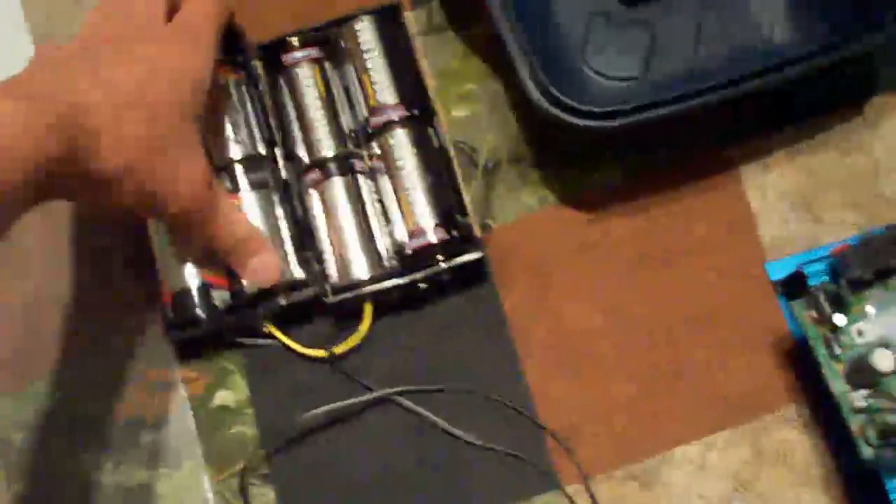The second step was I took apart this miniature amplifier and I am going to put it into the plexiglass. The third step was I made a 12 volt power supply for the amplifier. I've got the speakers and the mineral oil — everything under this plexiglass will be immersed in mineral oil. Above will be the battery packs, the control panel for the power supply, a hookup for the power supply, and a lead for audio in. Everything below will be immersed in mineral oil, which will protect the electronics and equalize the pressure with the water.